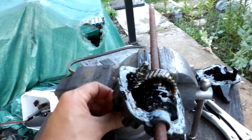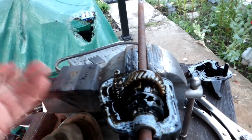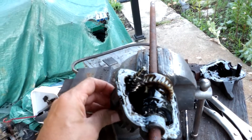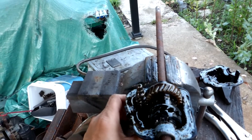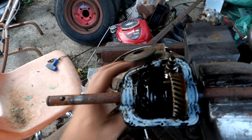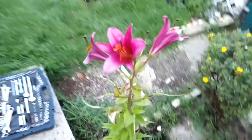From a gear reduction perspective, it takes one turn of the worm for each tooth on the wheel, so this could be something like a 35 to 1 reduction — you can't obtain that with any other type of gear using just two gears. But friction-wise they generate a lot of heat. Anyway, that's what's inside the transmission on a push mower like this Craftsman gear drive over here.